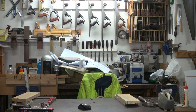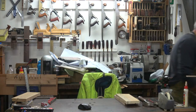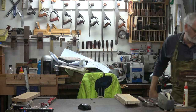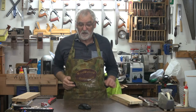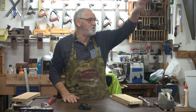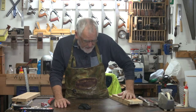I was going to send you a photograph of it, but I will tell you, the blade I have on my drop saw is an Irwin 40 tooth. I think it might be a rip, or what is it? Professional wood cutting. No, it's a 40 tooth general purpose. 254 mil, and it's a quarter professional wood cutting 93003. Got it from Bunnings and I think it cost me about $20. So that's what I've got on my drop saw, because to me, saws aren't a finish. They're a waste removal thing. Doesn't matter if it's a bandsaw, a drop saw, table saw, jigsaw, scroll saw, they're waste removal. After that, that's when your hand planes, your chisels, and your technique comes in. So anyway, all right, let's go back over there.